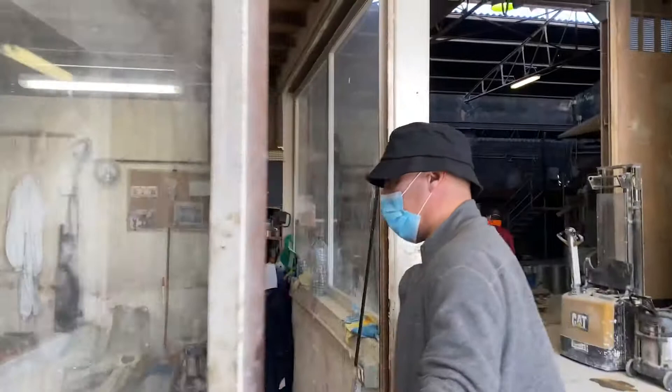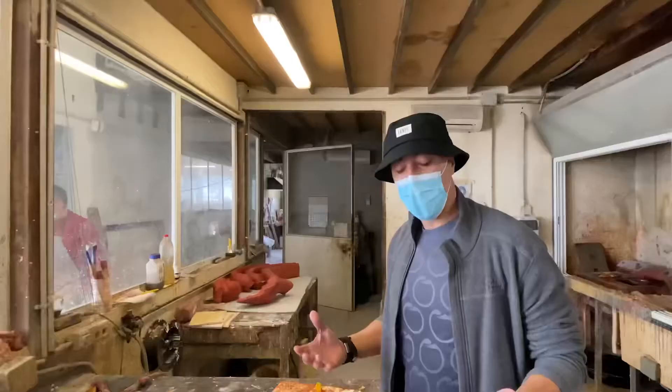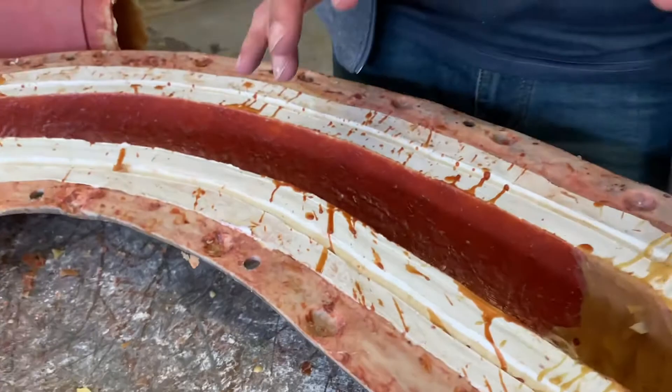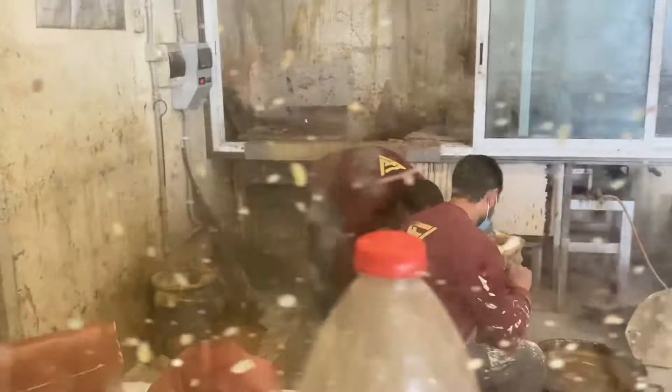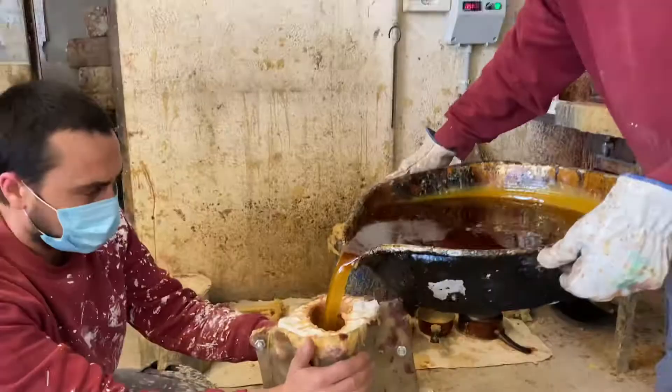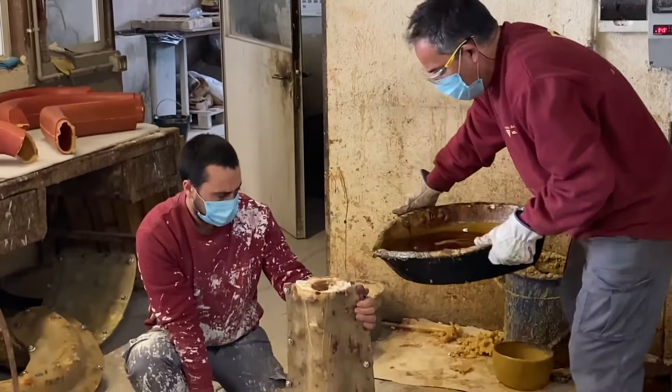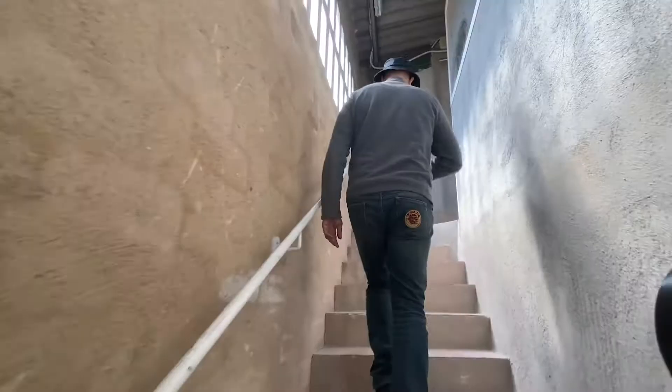First, we have to have created a mold — a silicone mold. This is silicone, so it needs an outer shell that will keep its shape. Inside it's the mold of the original piece that I made, and then we start placing wax inside to a thickness of up to about one centimeter, which will then become the thickness of the bronze itself.